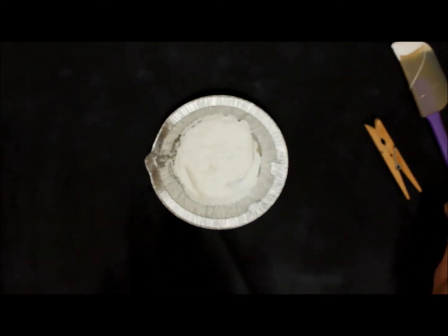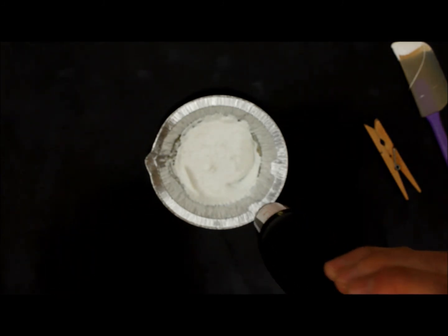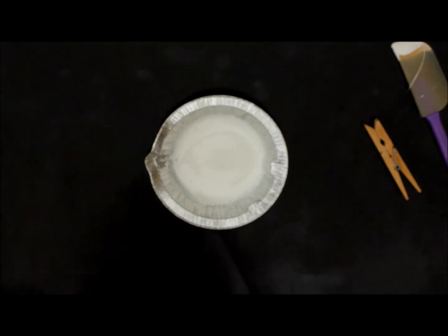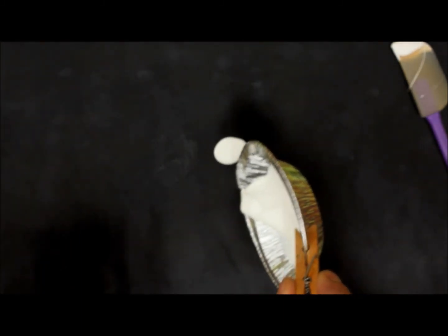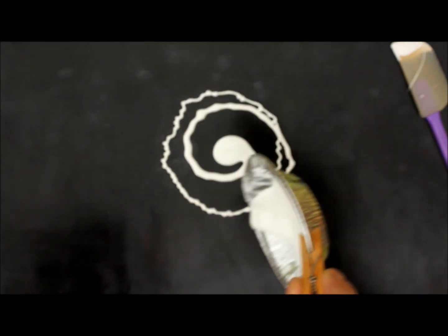And at this stage, because it's liquid, you can heat from the top. The powder's not going to go anywhere. Heating from the top's also great for getting bubbles out. So we now have very pourable molten colour mix.